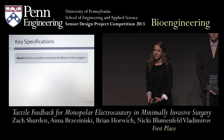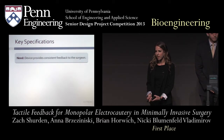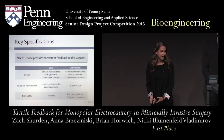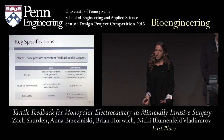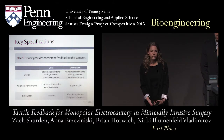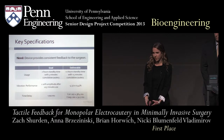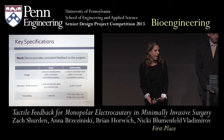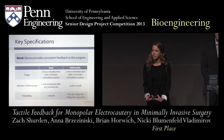Second, we wanted the device to provide consistent feedback so the surgeon could use it as an accurate indicator of when they are touching tissue. To satisfy this need, both the feedback component and the signal processor needed to withstand at least two hours of standby time and five minutes of cumulative cautery use. We also needed the actuator vibrations to be maintained within this interval — within a range of plus or minus 10% amplitude. For our prototype, we achieved just a 4% decrease. Finally, we wanted to minimize time delay to achieve as close to real-time feedback as possible, specifying less than 700 milliseconds.